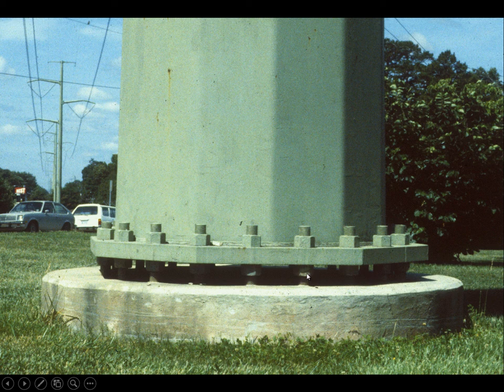On the bottom here there is a leveling nut, and on the top is the so-called locking nut. This is the classic base for every steel column — a steel plate about an inch and a half thick, while the wall of this tube is only a quarter of an inch. The wall of the tube acts in pure axial compression or, under wind load, some of it acts in tension. But this base plate is acting in bending, and we worry about stress concentration on these welds. So this base plate needs to be really thick and really stiff.